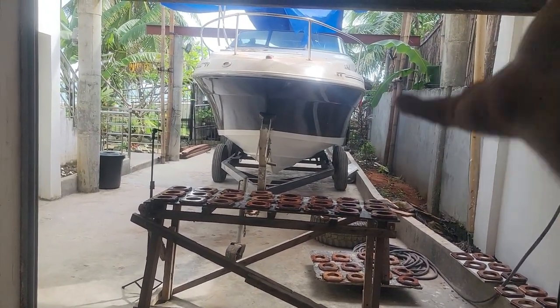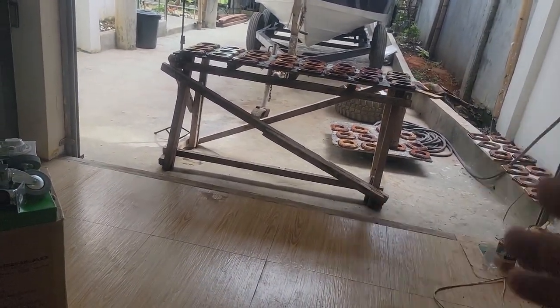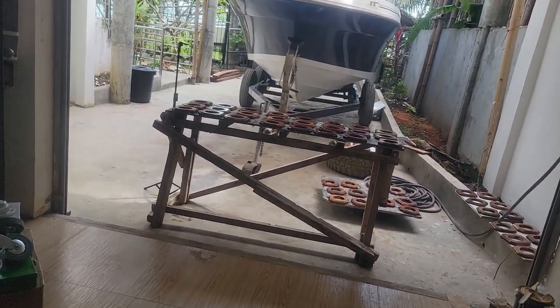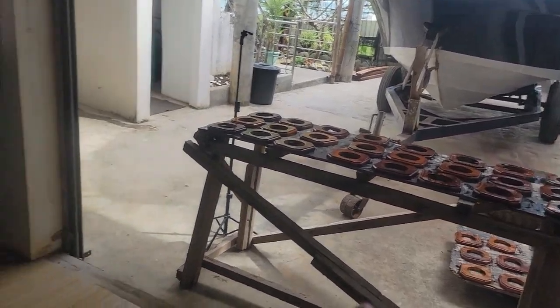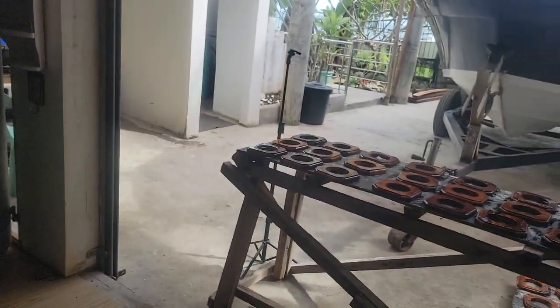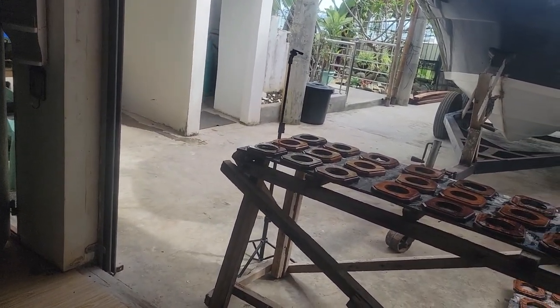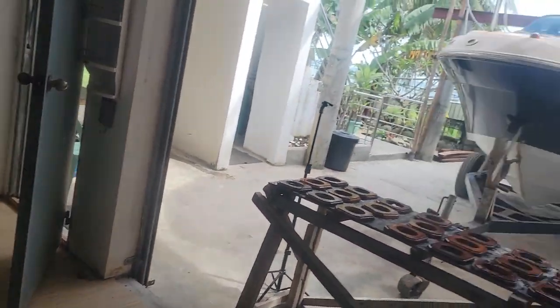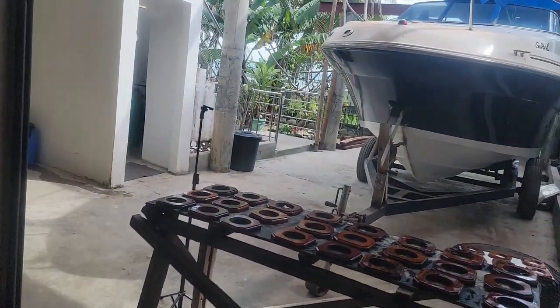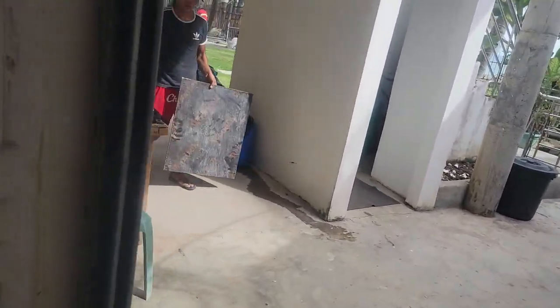When I set the existing motor from the boat out, I can set it on that dolly too. I can take some wood blocks and mock up where the motor mounts go on that marine engine. Motor mounts on a marine engine run right on a stringer — a stringer is just a fiberglass-over-wood block — so it's simple to put blocks on the sides with bolts and mount the motor down. I've had that sheet sitting in my garage and those casters bought — I want to go ahead and get that made and done.